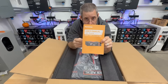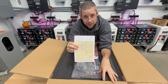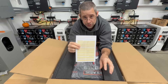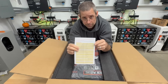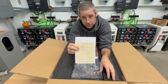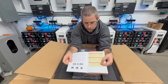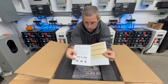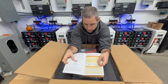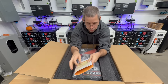Here is what the battery looks like — it has all the specs on the actual unit. This is a 48-volt lithium iron phosphate battery with a 100-amp BMS and a few different protections built in. The first is overcurrent, which will trip at 120 amps within 10 seconds if exceeded. It also has short-circuit protection, and it comes with communication via RS-485 and CAN connectors, plus DIP switches for configuration and LEDs showing state of charge.